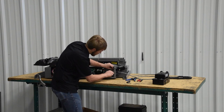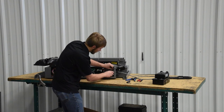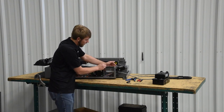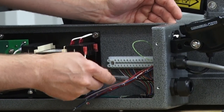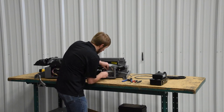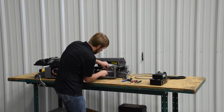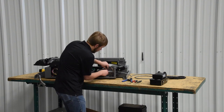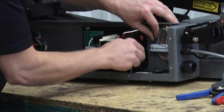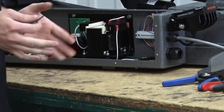Inside the relay box, in this pole strip here, all of your wires will be color for color. All the wires that you're putting in on the top will match the color of the wire beneath it. Once you get all your wires into the pole strip, get them all tightened down and verify that they're all color for color. Your control part of the installation is complete.